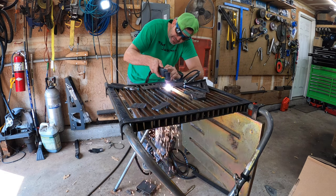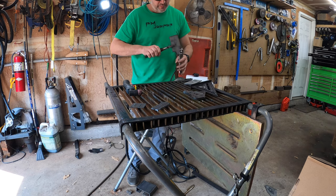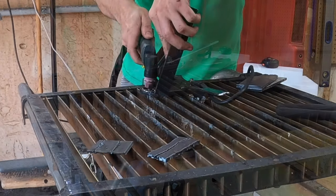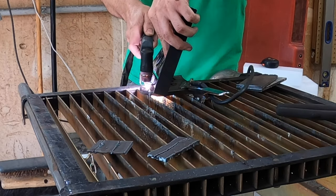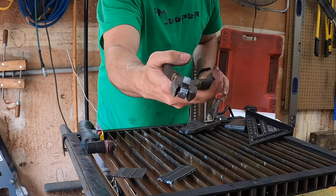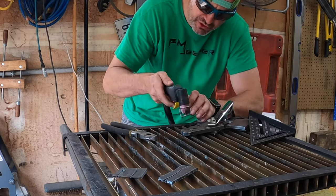At 46 amps, let's try quarter inch. That's actually a pretty thin cut — yes, quarter inch! Let's move up to the big boy stuff: three-eighths. Wow, I can do this. I did three-eighths relatively cleanly and relatively straight considering I was basically freehanding it. Let's do one more on three-eighths — I'm going to freehand it and try to be as smooth as I can.